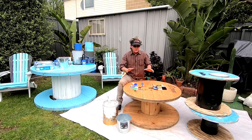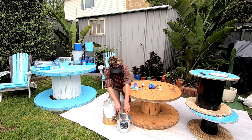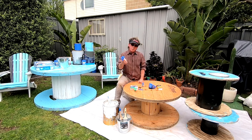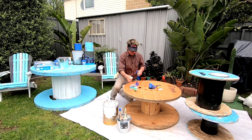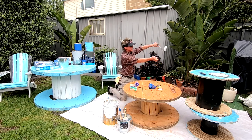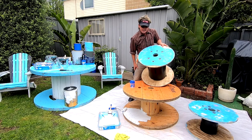Got these sanded. Now there's a little bit of prep before we start throwing some paint on. Grab your paint brushes that you're going to use and pop them in an inch of water. Leave them in there for about 15 minutes. And your roller — before you use your little mini roller, which are ideal for this, moisten that up as well. Squeeze the excess water out of the roller, click it on your smart lock handle, and spin the excess water out. Your brush and roller will work better because they're moist like paint. Little painter's tip.